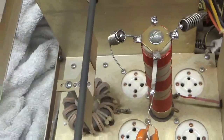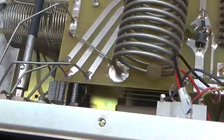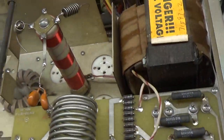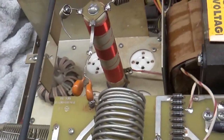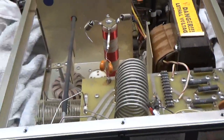This is an older one - I prefer these. It has the open frame relay. I'm going to clean the T/R relay. The SO239s are good. I'll clean the rotary switches with Deoxit Gold. Check all the solder joints, make sure all the screws are tight, and then I'll test it for full output on every band.